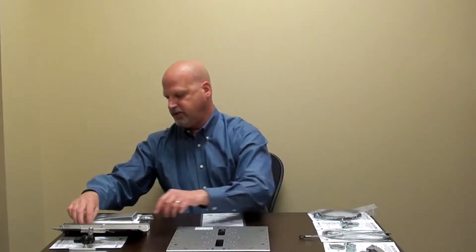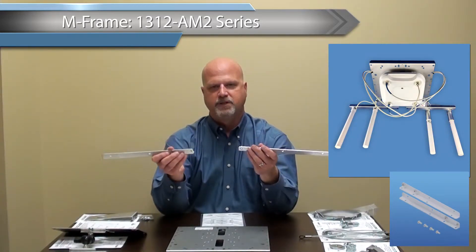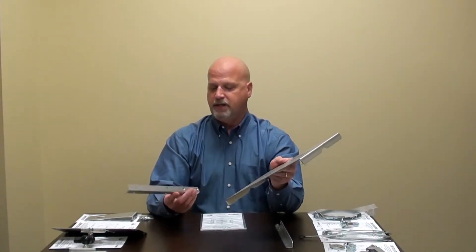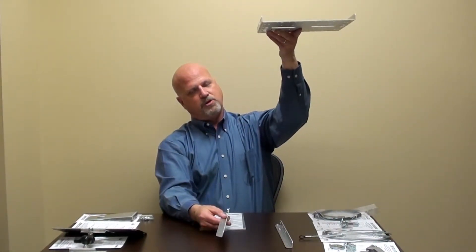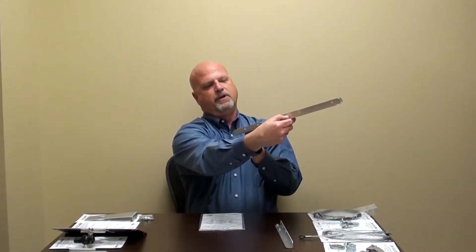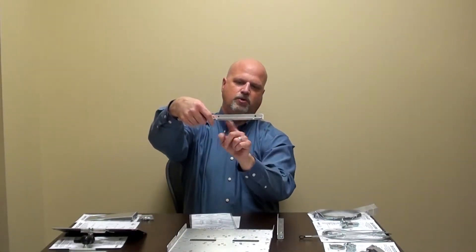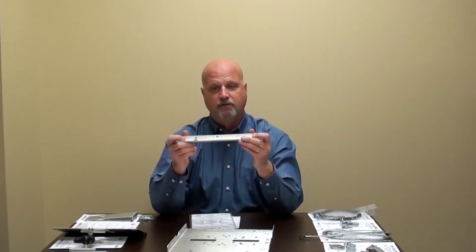The next antenna attachment is the AM2, for single band pipe antennas — the 8-inch pipe antennas. These aren't used as much anymore, but some installations call for them. When the M-Frame is mounted horizontally in the ceiling, you attach an arm to each side, and pipe antennas attach to the holes on those arms. Typically you'd see two 2.4 GHz pipe antennas on one side and two 5 GHz antennas on the other side. They are available just in case.